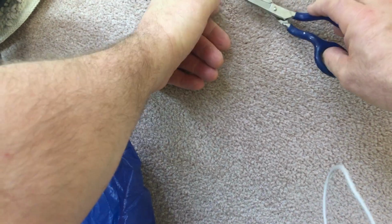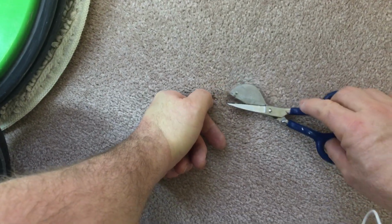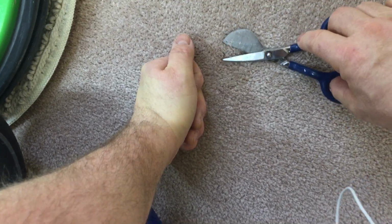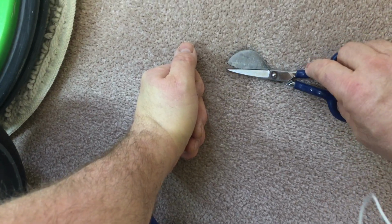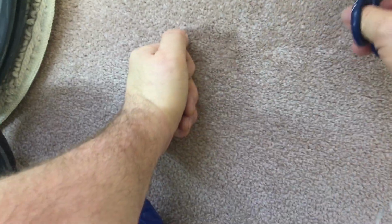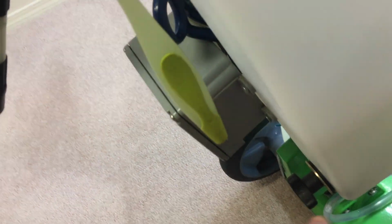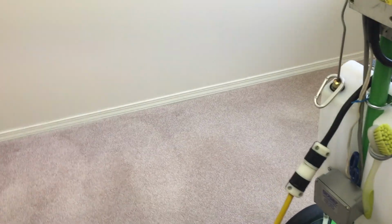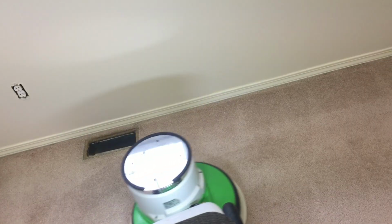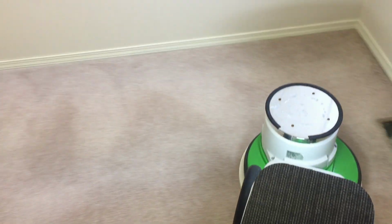It's just a little bit on the tips. When you do that, try to feather it in a little bit too, so it's not touching all this dimple. So there, that'll do, I think. Okay, now there you go. It's gone. You just see the little dimple there. And when it gets walked on, it'll just disappear in no time.